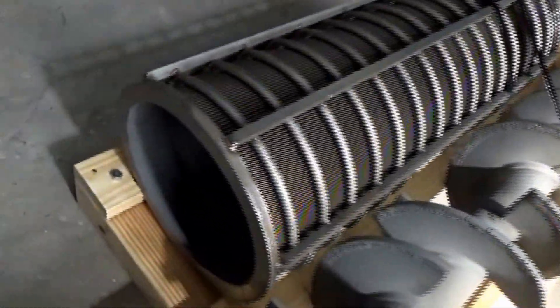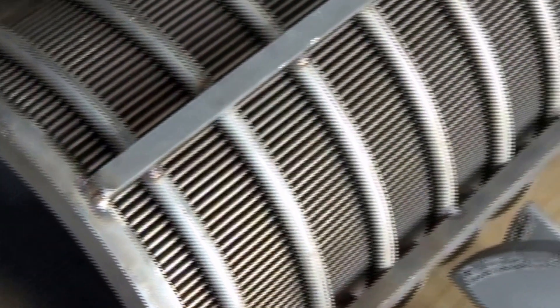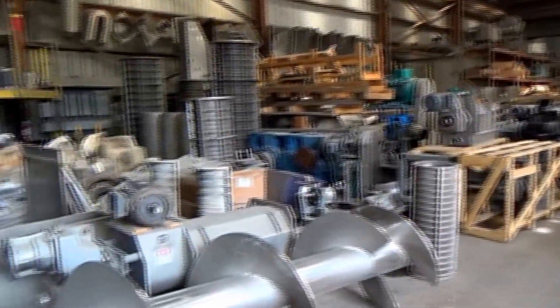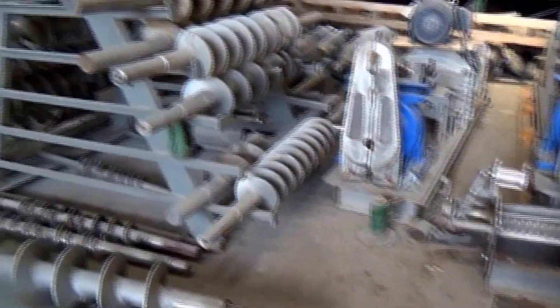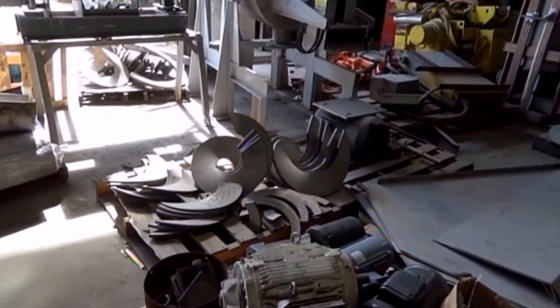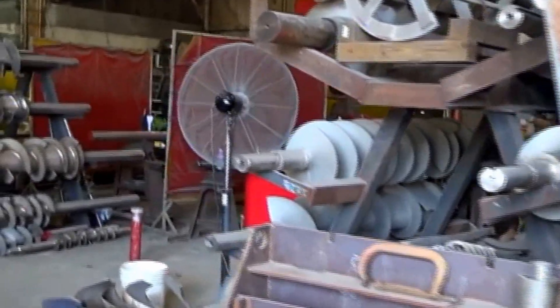Here's the screen that's going to go with this. Remember I mentioned the slot? There's the slot on the inside — 15 thousandths that I was talking about, though that one might be 20 thousandths. These are some of the 200-some rental presses that we have. Getting into the screen department — we make screws here. These are screws and flights for screws, and we've got a lot of flights because we make a lot of screws.